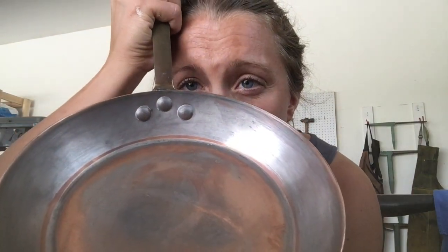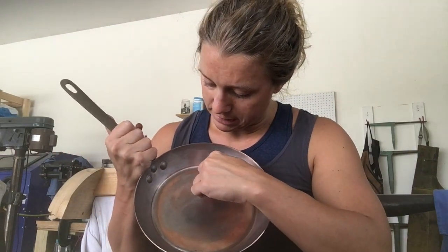I don't know if the rivets are going to show up, but you can see how clean they are — it's almost silvery right here. These are really really clean, they're ready to go. But what I'll do right beforehand is an additional acid bath — a different acid — just before I line these up to get dried and put over the fire. With that acid I take another wire brush and scrub, because I really want to get all of the dirt out of every tiny crack I possibly can to make the tinning process a lot easier.